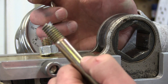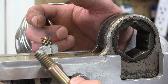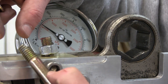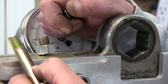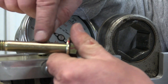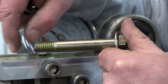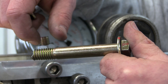Head bolts, all that sort of stuff — that's a lot of work. You might want to check them out real close before you reuse them. If you can reuse them, and if a couple bolts don't break and don't kill anybody in that scenario, then what you can do is take a nut and run it down on the threads. If it runs down nice and clean and easy on the threads, you can reuse the bolt — because the shank diameter here is larger than this diameter. So the bolt, the fastener, is always going to stretch on the threads. If you can run a new nut on the threads, then we know it's not stretched too much. We can reuse the bolt.